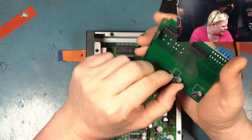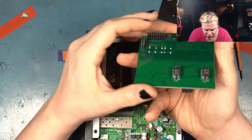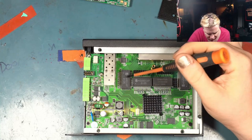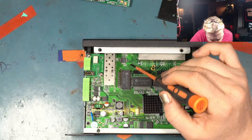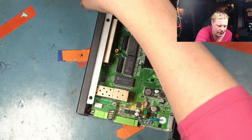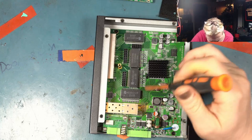Looking at the caps on the bottom — I don't know why they're oriented like that; my OCD brain says they should be upright. I'm not sure if that happened in shipping or if UPS slammed them. Taking this out, we've got magnetics here — four sets, each handling two ports. There's a Realtek chip right here that may be the console/serial interface chip. The power section runs along the back and carries up through headers to the power board above.